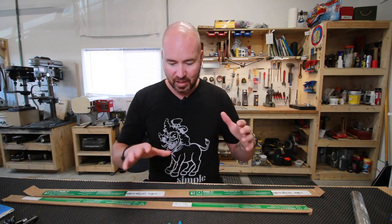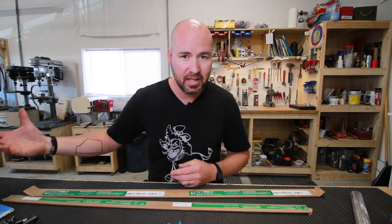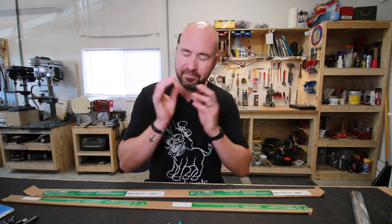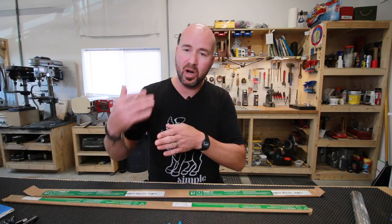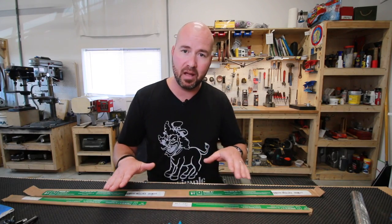What I do now instead is that as I'm folding up my pouch, before I fold the very last corner over, I try and squish as much air out as I can, and then I fold it. Now, once I'm at the austenizing temperature, 1950 degrees, obviously there is going to be some, how much, I don't know for sure, but there is going to be some decarburization. But again, with a limited amount of oxygen in there, once it's done eating away at that steel, there's no more oxygen, it's going to stop, right? So I've had really good success with not putting anything in there and just squishing out my envelope super duper tight.